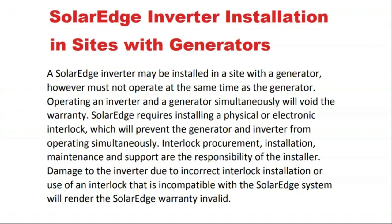The microinverters with Enphase are much easier to install for beginners, so they're very popular with do-it-yourselfers and first-time installers, whereas most experienced residential installers in the United States transition to SolarEdge at some point. Okay, well, SolarEdge is a grid-tied inverter. It's not a battery inverter. That's a dilemma that a lot of solar owners are in today, where the solar inverter manufacturers are producing products that are not intended for batteries. Even when they come out with a battery inverter, it's intended for a small grid-tied battery to back up a critical load and not run a whole house.